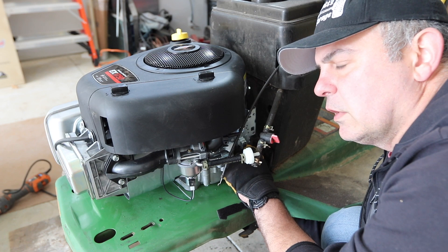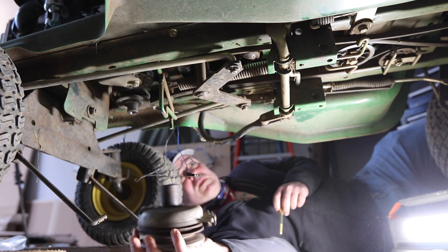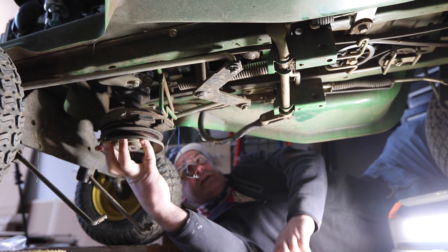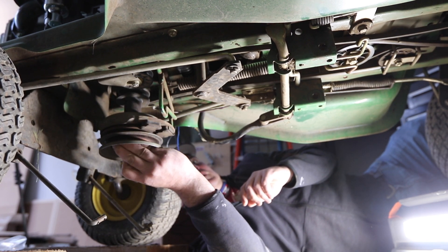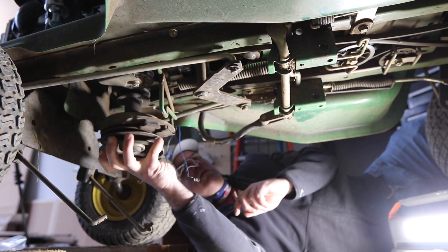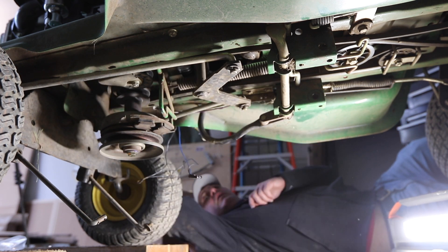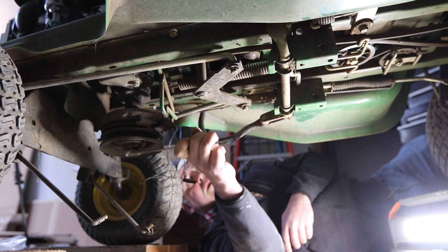I'm going to use a lock washer, double-nut it, and probably Loctite it. As I mentioned, they were nice enough to send the shaft pre-rusted, so I put a little bit of anti-seize on the shaft. Another thing I didn't mention: the only difference between these motors down on the shaft is the bolt — the stock bolt is a three-eighths fine thread, and this replacement one is a seven-sixteenths. Luckily this hub accepts the seven-sixteenths, so I just had to run to the parts store and get a seven-sixteenths fine-thread four-inch bolt. The motor turns. Good.